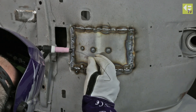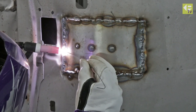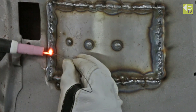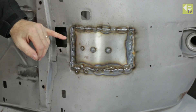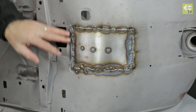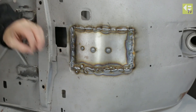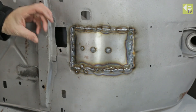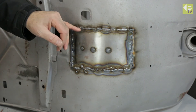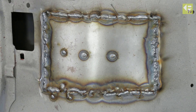I'm nearly completed — just this last section to do now. Hopefully you can see the difference between the MIG weld where you've got a lot more material added, compared to the TIG weld which has much less material, and if the joint fit-up is good you get an absolutely flat surface with minimal refinishing. So in summary: TIG welding is a slower process with less material build-up; MIG welding is much faster but you've got more finishing to do afterwards, though it is more tolerant to larger gaps in the material. Thanks for watching and remember to subscribe to our channel.